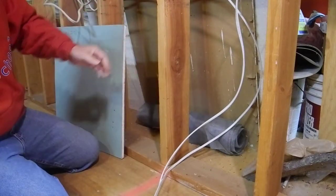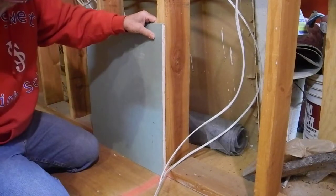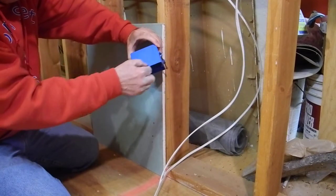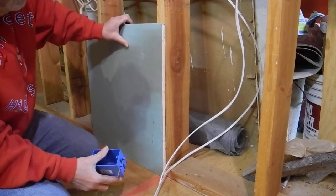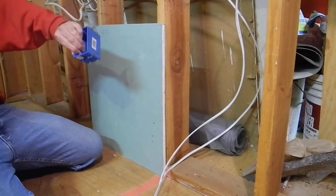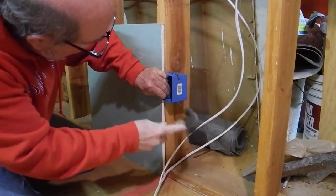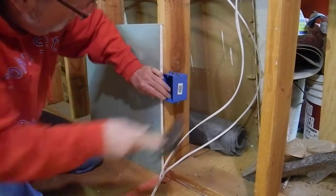The wires have already been drilled out through here — that's a whole other video. We want to put this thing flush for sheetrock, so it'll be flush there. The sheetrock won't be installed when you do a house, but on the back of this there are little marks and tabs for doing this. What I like to do is hold a piece of sheetrock or just a half-inch piece of plywood off at the right location. When you hammer it in, it'll be flush. What's actually better than flush — you don't want it sticking out, protruding past the sheetrock.